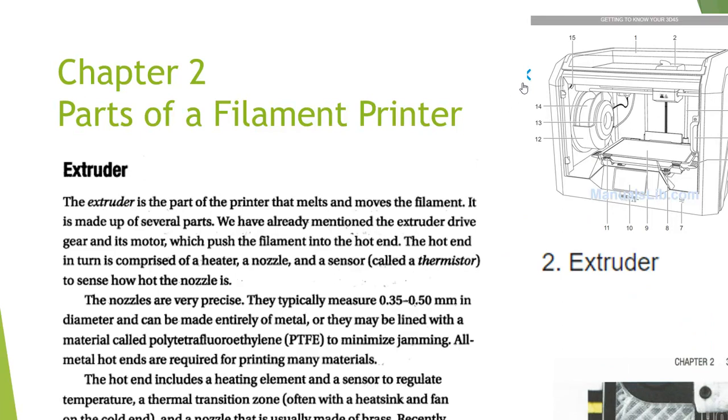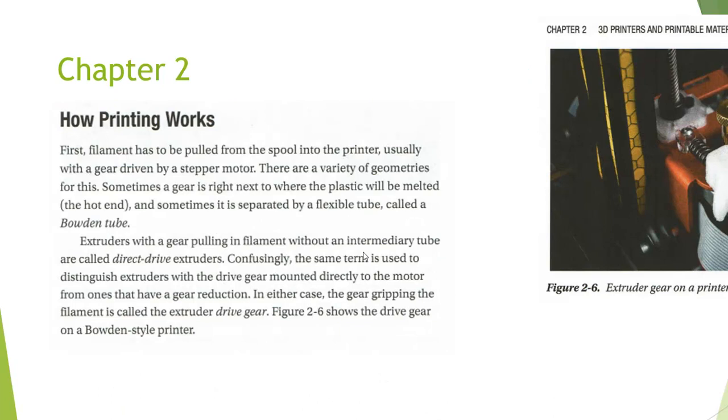The extruder is located right here. It has a nozzle and the plastic will be fed up into the extruder, then feeds down based on the G-code feed and speed rates set by the slicer. Different materials will have different feed and speed rates to perform optimum filament extrusion. There's a gear that will grab the filament and bring it into the nozzle through a Bowden tube — which is just a piece of plastic, essentially a straw.